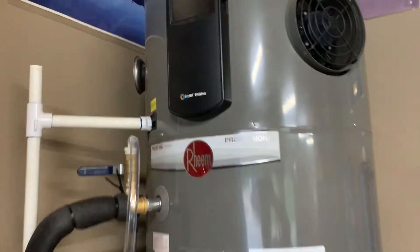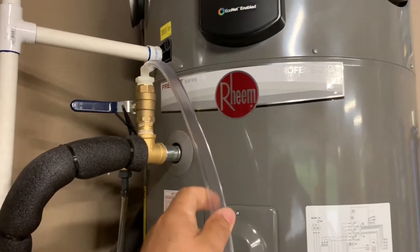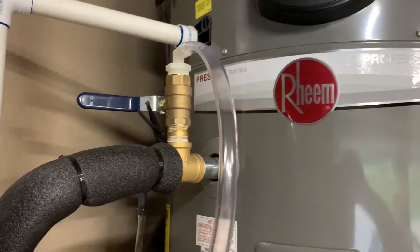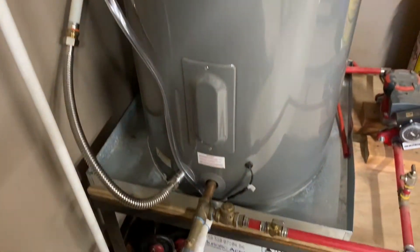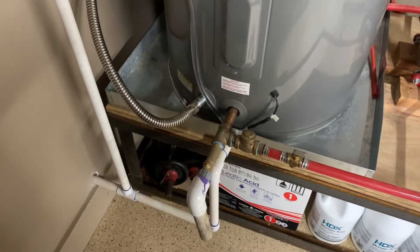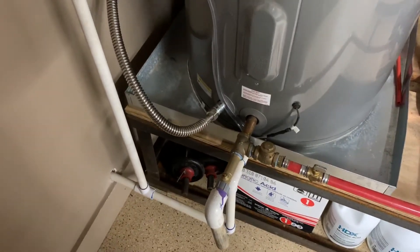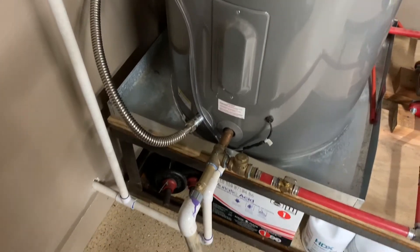Once a month you can add hydrogen peroxide — you can get it at the store for 89 cents. I had a valve put on the hot water line; this is the hot water coming out. What I do is put a drain bucket underneath the drain here, open up the drain, and let about one gallon of water fall down from the hot water heater. The vacuum created inside puts a negative pressure and it'll only drain out about one gallon.